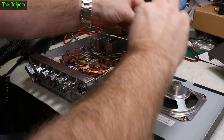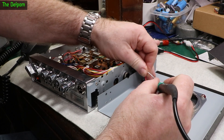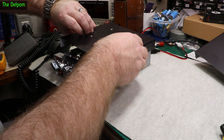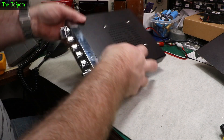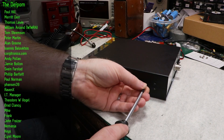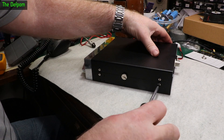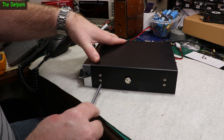Now I'm going to just twist these wires together. I think it actually helps a little bit with RF, and it also helps to keep it a bit tidy — I just like to twist the wires together for the speakers. I've actually been asked in the past about these modules that I have in these radios, about whether I can sell them to people, and the answer is no, because it's for New Zealand channels. I have those modules custom-made — the oscillators are custom-made. I ordered those especially to do this conversion on these particular radios. So it's all the alignment stuff you need to do as well and get all that right.